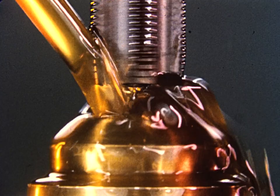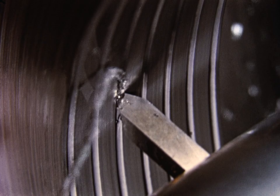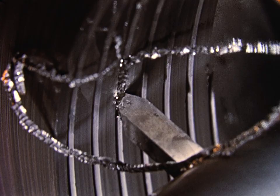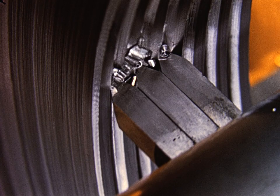To see how screw threads are cut, let's watch a thread being cut on a lathe with a threading tool bit in a boring bar. Normally, this requires many passes. To illustrate another possibility, let's use a series of tool bits chamfered so that each takes a slightly deeper cut. The result is a thread in fewer passes than with a single tool bit.